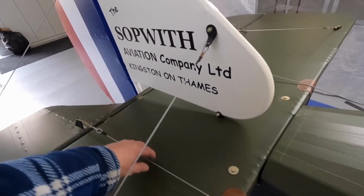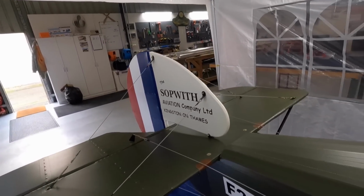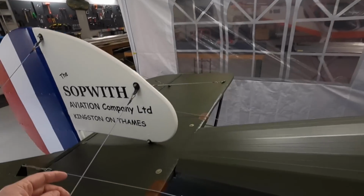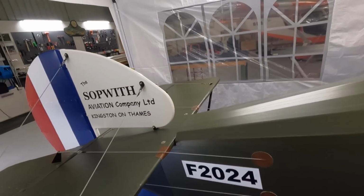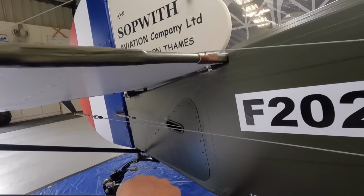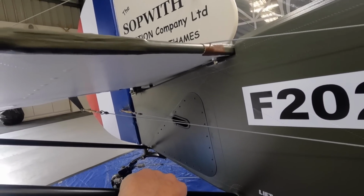Looking at it now, I think what I'll do is take the weight of the elevator and then I'll set my cable tensions. I think they're down as low as 20 pounds on the cruiser. These were 30, 35 from memory, or that might have been these ones. So they could potentially be backed off a bit. Someone else mentioned leather patch on the panel. Yeah, probably could have done that. I'm quite happy with the way that is at the moment. You don't see it anyway.